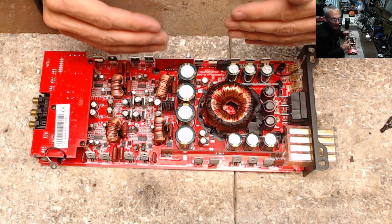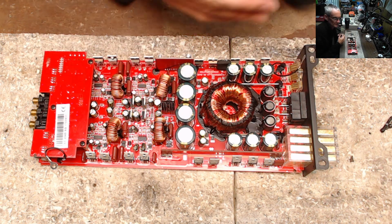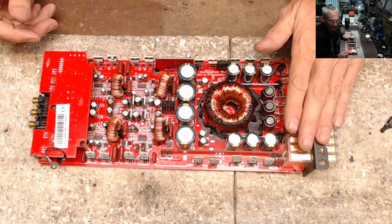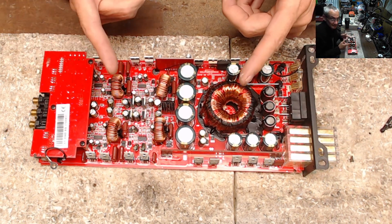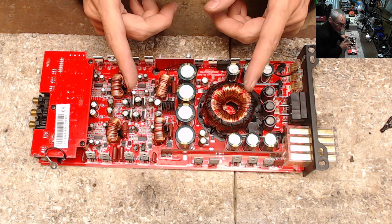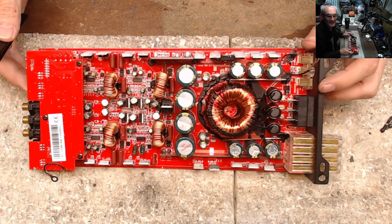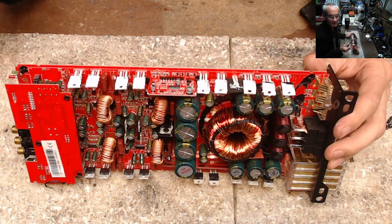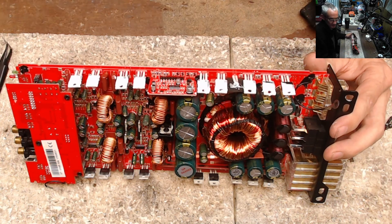So if you are having a 110-degree day and your system failed, and you went back and touched the heat sink and the heat sink was not scorching hot — that is in itself a problem. Because this one single item that determines the temperature of this amplifier is right here.